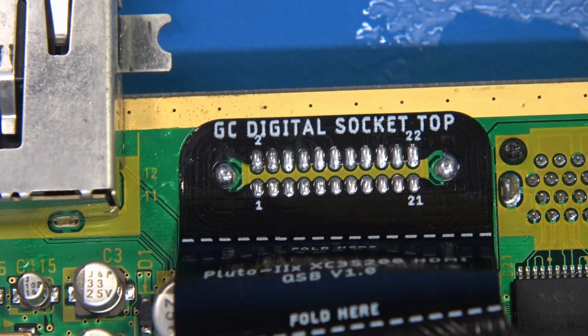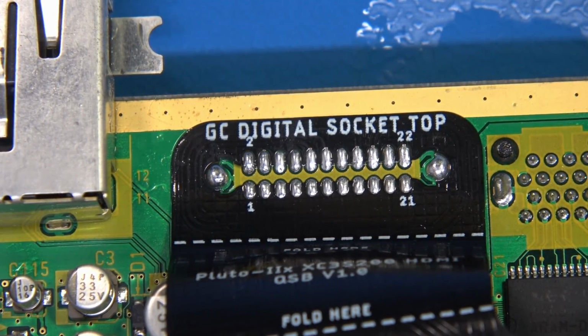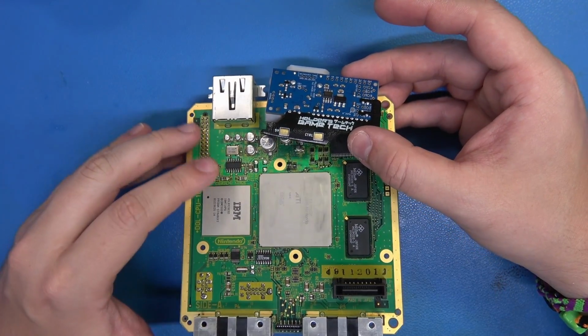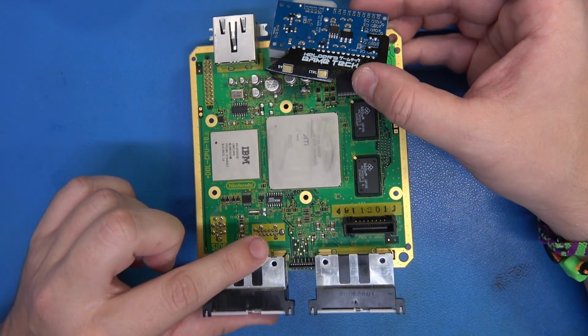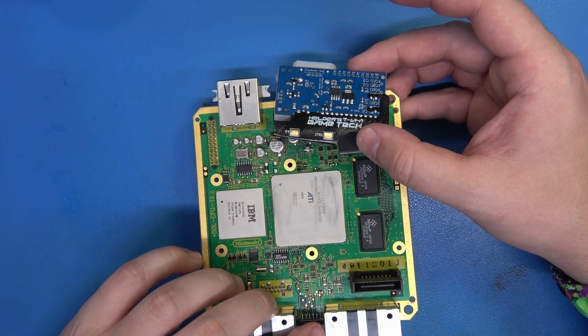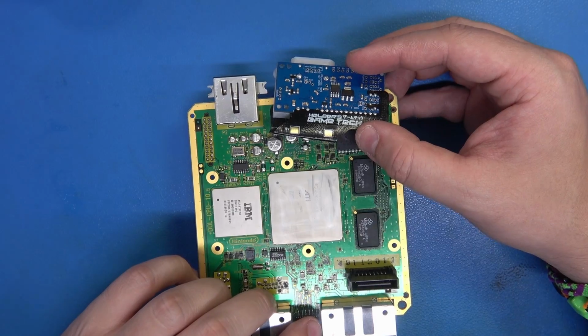Well, I have to say, it doesn't get much cleaner than that. Okay guys, great job. Let's keep moving on. Guys, great work. Now we have two very large solder pads here on our flex. We've got to grab 5 volts from over here, and the controller hook is right down here on a test pad. So we'll go ahead and tin these up, and we'll finish this little part up right here. Let's go for it.